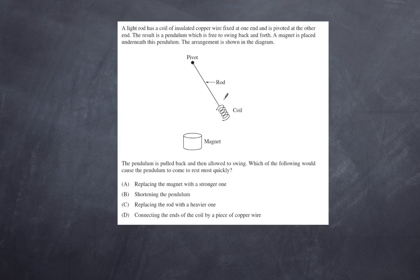What we have here is a coil. This coil is going to be swung back and forth through a magnetic field, so it's going to experience a change of flux. An EMF is always generated when there is a change of flux. The negative symbol in Faraday's law relates to Lenz's law, which says any induced EMF will produce a polarity that opposes the motion — in line with conservation of energy. To produce eddy currents you need material that allows currents to form in circles.